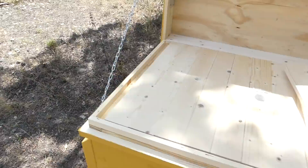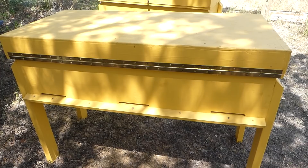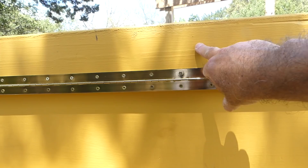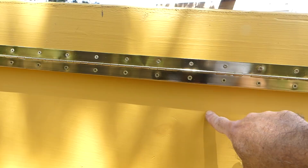Let's walk around the hive here. My hinge. We have the hive entrances — there are three entrances. Two of them will be blocked, one will be used. Maybe at some point multiples will be open, but initially it'll just be one. And then we have the long piano hinge, or the long hinge here. That long hinge is really good because we can put a bunch of short screws in. This is only three-quarter inch material, so these are three-quarter inch screws. And then on the bottom I used one and one-quarter inch screws, just to be a little more secure going into that bottom board. So we have a three-quarter inch lip on a one-half inch board.